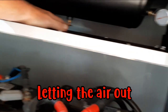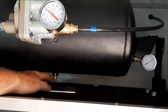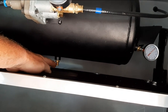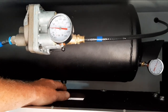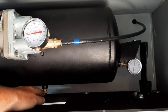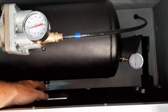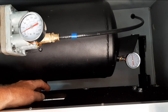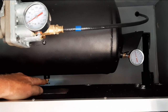How do you let the air out? I've got this little petcock valve down here. What I'm doing is rocking the petcock valve back and forth a little bit to break down the ice crystals that form when you open up the tank pressure — because when the air rushes out real quick it gets super cold and makes ice crystals. Wiggling the valve back and forth breaks it down and helps the air drain out quicker. That's why you hear the popping and sputtering of the valve as the air pressure drops down in the tank to zero.